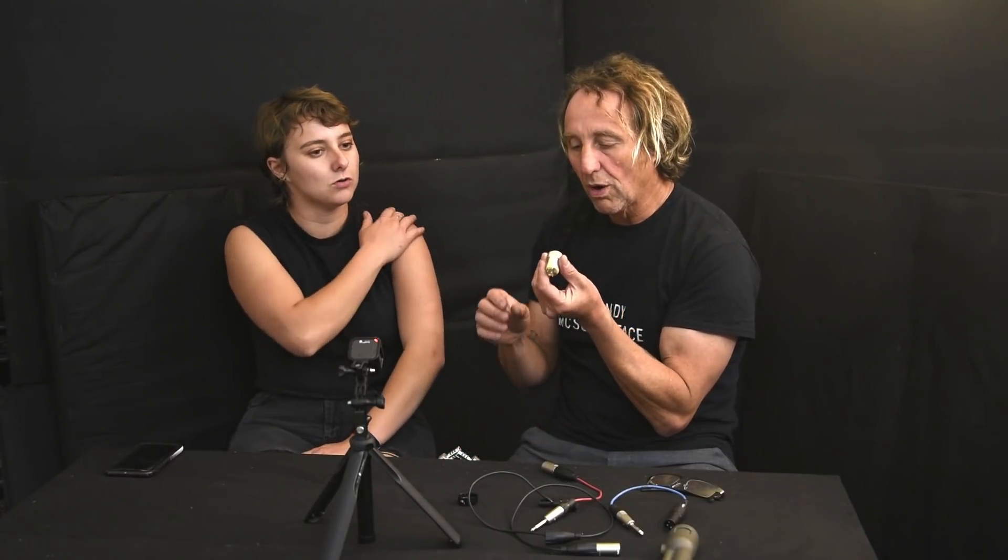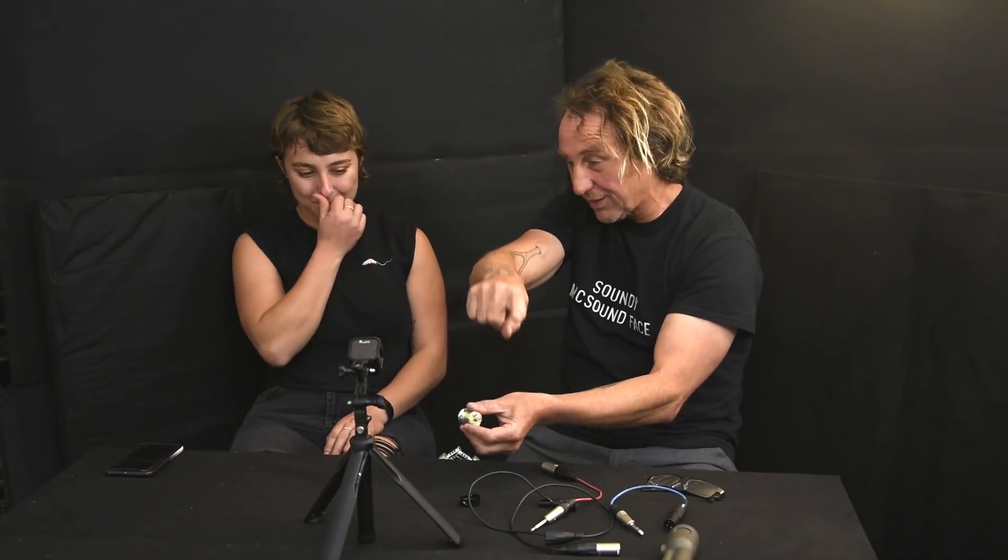There's a coil of wire in there, and the coil of wire attaches one side here and one side here. When that coil of wire moves in the magnetic field — because there's a little ring sitting in there — it generates electricity. On the current wiring of XLR cables, which hasn't always been the case, we use pin 2 hot. This red terminal should be pin 2, which means a positive pressure. A positive pressure moves this inward, and a positive voltage shows up on this terminal, which makes its way through some wires and shows up on pin 2. The negative voltage when you push on it shows up on pin 3. When you make a sound it goes in and then out — positive versus negative — and that goes all the way through.